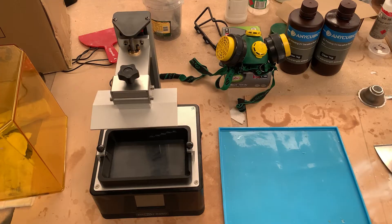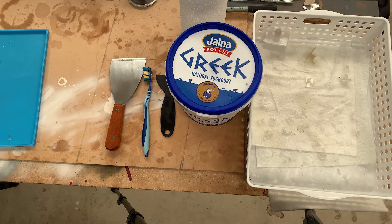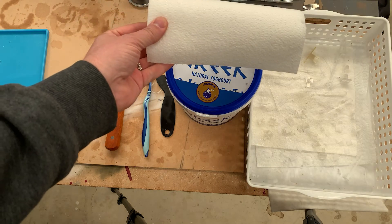The parts then go over to my wash station. Here's a close-up of the cleaning station — I have all my tools ready: the metal scraper to get prints off the build plate, the toothbrush, the plastic scraper, and isopropanol. You can also see some prints drying, ready to be put under UV light for hardening. I want to make it absolutely clear — when you're touching any of this stuff, it's always with rubber gloves on. As you work across the station, you're dealing with contaminated products.